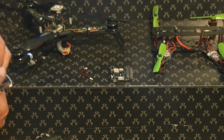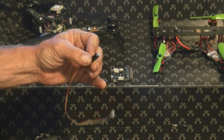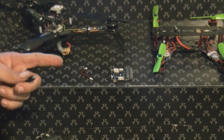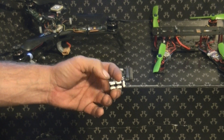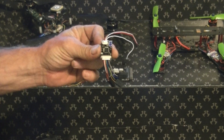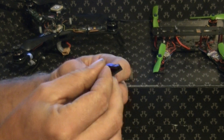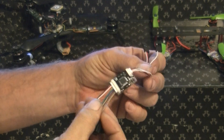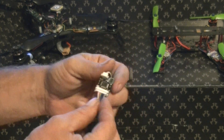What you will get is a bunch of wire connectors, though honestly most of them don't plug into what you need them for. You will get a safety switch — it does have a port for one — and you also have the option in software to eliminate the safety switch function if you don't really want to use it on a small craft like a 250-size or a Hobby King Trifecta. You do get an I2C splitter board for external LED lighting or multiple I2C connections. It also comes with a PPM encoder, since the Pixhawk will not take multiple RC inputs — only a single S-Bus style connection or CPPM. So you'll need a PPM converter if you don't have an S-Bus or CPPM receiver, but that's included.